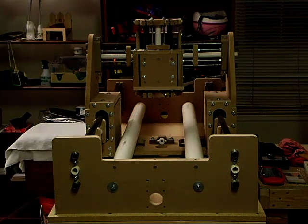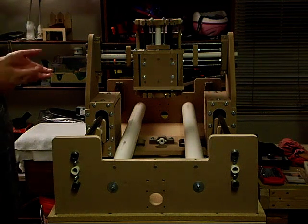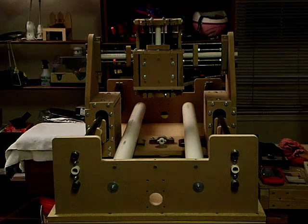The whole design is currently using 10 TPI screws, same as the previous machine, though hopefully I will be closer to 60 IPM on this one. I am using surplus motors — maybe 220 ounce-inch motors — going to be run by the Gecko G540 board running 24 volts. EMC is the driving software, all stuff I know how to use.